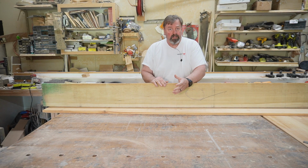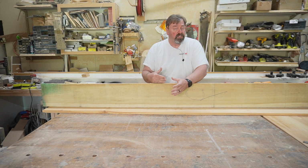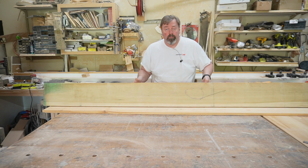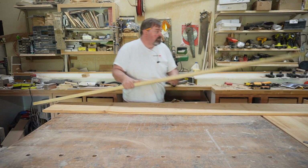We're going to round over the top and bottom part of our window stool, and then up underneath, on the second layer, we're going to add an OG edge. So it's going to be a little bit fancy. Then we can go ahead and clamp that up and set that aside to dry. And then we'll start cleaning that window up and get everything prepped and ready to go. First thing though we want to do, we'll cut it to size and we'll get everything planed.